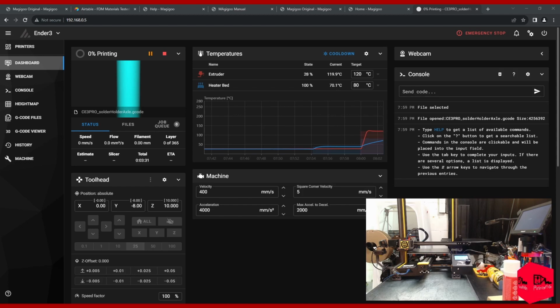Okay, we're at 70 degrees, going up to 80. As soon as we hit 80, that hot end will warm up, start printing. Fans kicking on for the power supply. And this printer currently, yeah, we don't have the pre-print G-code macros set up on this one to do a bed mesh. So we'll see what happens. I don't think we do. We might. I don't know. It's been a while since I printed with it. Exciting. 75 of 80. Taking it a while. 76. It is about 74, 75 degrees in here right now. We're being 20 degrees outside.